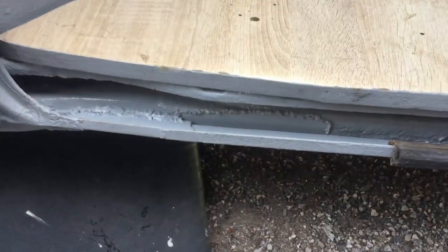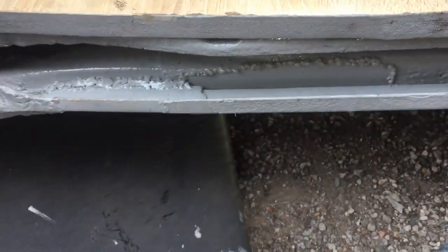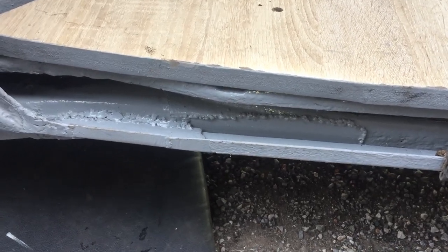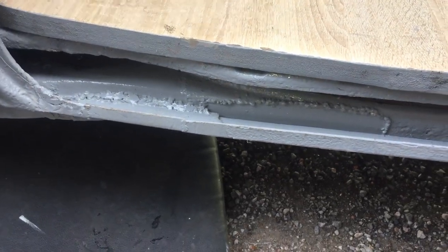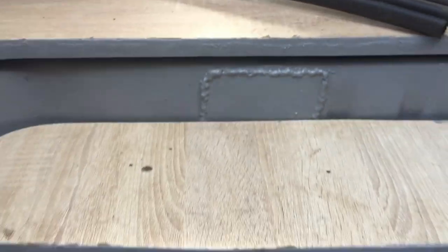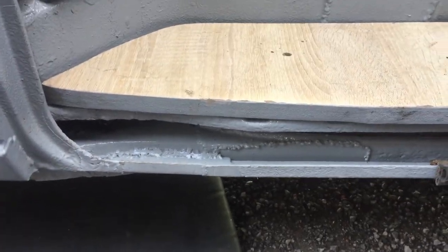So there we have it — that's the finished result. I've got mixed feelings about it. I'm happy with the metal work that I did, I'm happy that I've cut the rot out, I'm happy with the way it looks and this rubber seal is going to fit nicely on there. I'm not too sure about the strength of the welds — I am a little bit concerned, perhaps I should have given it higher heat or a little bit more wire speed. These are the kind of things I don't have the answers to, so if anyone can give me any constructive feedback that would be appreciated — I'm completely new to welding. But they look alright. I mean, I paid a professional welder to do that and it looks almost the same. I did also weld this from the back, so that's got a little bit of extra strength on that plate. I think that should be fine, but that's it for now — thanks for watching, cheers.